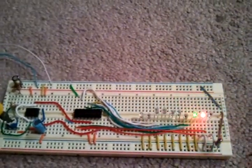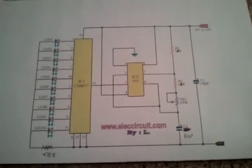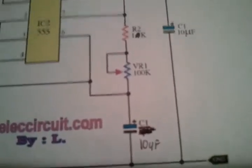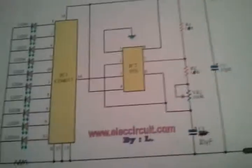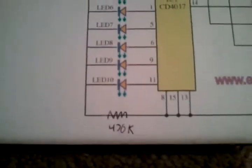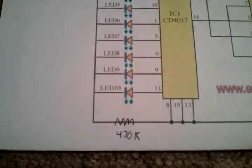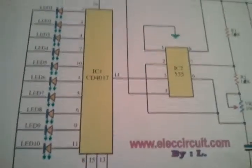I'll have the link for the schematic in the description. Here is the paper copy of the schematic. I have changed a few of the things: these were 1.5K, I changed them to 1K. This variable resistor, I changed it to a 203. And this capacitor, I changed it from 1UF to 10UF. And I put a 470 ohm resistor between all of the LEDs and the negative terminal. I will also put these changes in the description.